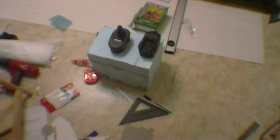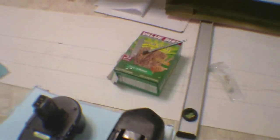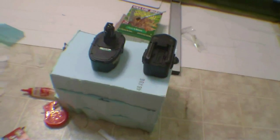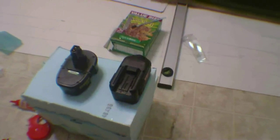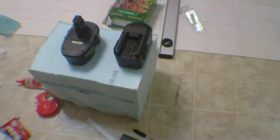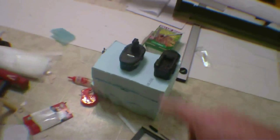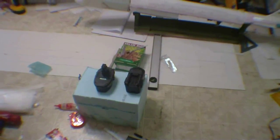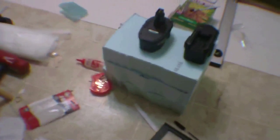So this is the next step — we're going to start boxing and epoxy these together and make an entire MD-80 nose section. Demon Driver here: the three pieces of foam have been epoxied together. I mixed up some five-minute epoxy, brushed it on, stacked the three pieces, and I've got cordless batteries sitting there as weights to hold it down. In about ten minutes I'll go ahead and start hot-wiring the top profile first, then the side, and we're going to make our MD-80 nose section.